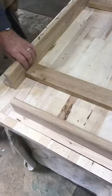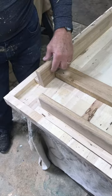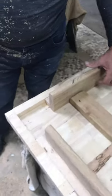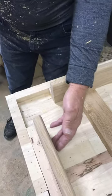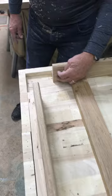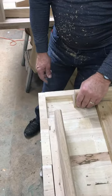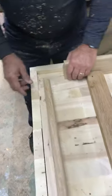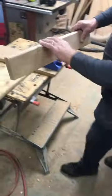I did pocket holes on the apron. The apron attaches to the top using pocket holes that go on the inside only. I also put two pocket holes here so I can screw them into the leg — this attaches the leg on too. I have to be careful I'm doing the right side, so I just do one piece at a time.